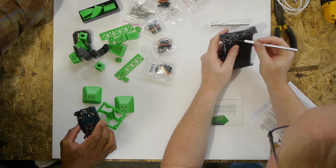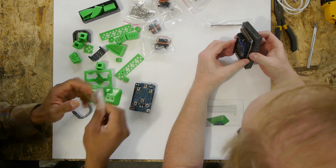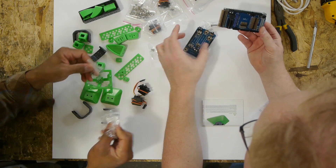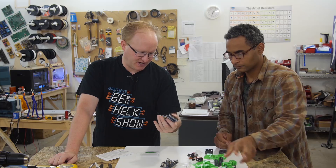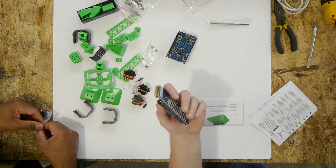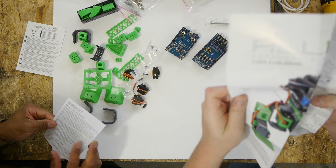Comes with a bunch of screws, a screwdriver, and four servos. This must be some sort of shield for the Arduino. The Arduino has become like the light socket of the kit world. Oh, this is like for a mega — we don't have any of those. So we have a battery board, which is mostly just breakouts, and then a motor driver board, which is also just breakouts. Oh, look, there's the IR receiver right there. Yeah — switch, big capacitor probably for the servos, and a speaker. This is probably going to be five volt power coming from here, so you don't have to drive the five volts for the servos through the Arduino — you would just send the signals.